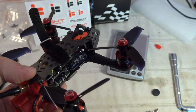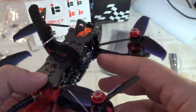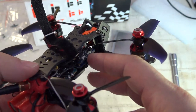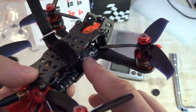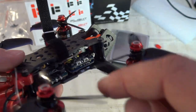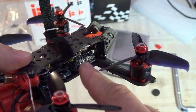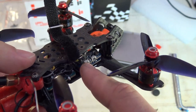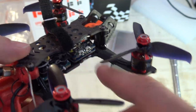There is the auto recording option. As soon as you reboot this quadcopter, the recording will be turned on. So you will need at least to press one button to stop at the end of your flight. The rear button here, a long press is to enter the OSD, so you will navigate between different options by pressing the front one, validate by short pressing the rear one, and exit from the current menu by long pressing the rear one.